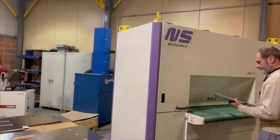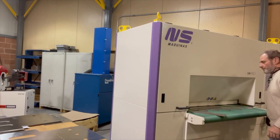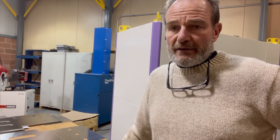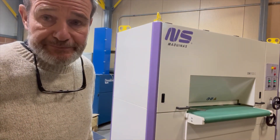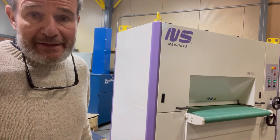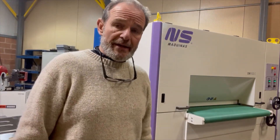Now we go over here. Can you get an idea about how many parts you can actually run at three feet a minute? You can see how quickly they disappear in there. If you had hundreds of them, it would be a lot easier to keep that table filled. You should have a chute in the back if you operate the machine by yourself, or simply a table that you can push onto — this way the parts are not dropped like they are in our demo setup here.